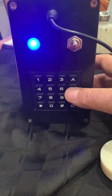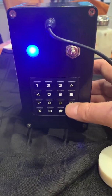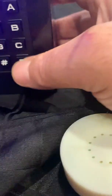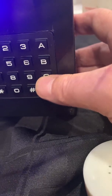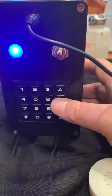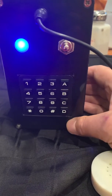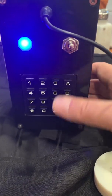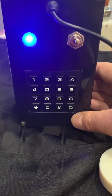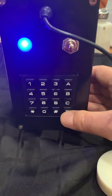In this mode it's possible to adjust the volume of the box using the B and C keys. Right now we're at max volume. You get a high-to-low beep as you reduce volume, and when the limit is hit it plays a 3-beep warning. That's max volume — there are 15 steps supported, and the volume level is stored in memory so when the power is turned off and back on the box powers up at the previously stored volume level.